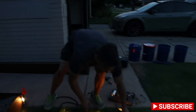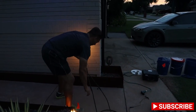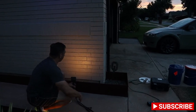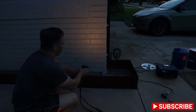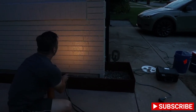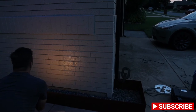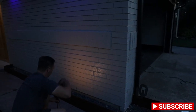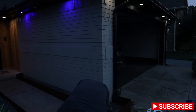One other one we have here is a wall wash. A wall wash is exactly what it sounds like — it has a wider head and a wider area. As you can see it's going pretty wide. It comes with different lenses depending on the width and brightness you want — 2700K or 3000K. It does a really good job of lighting up a wide area with soft light.